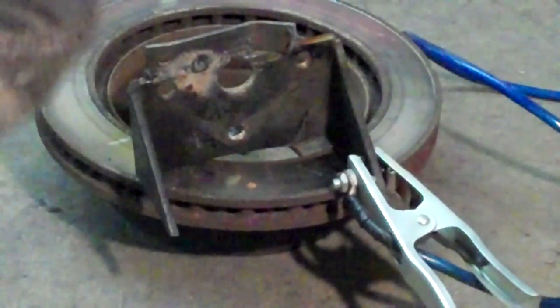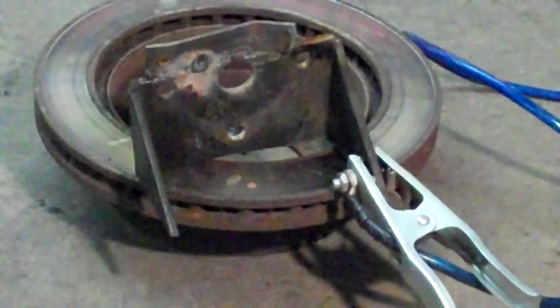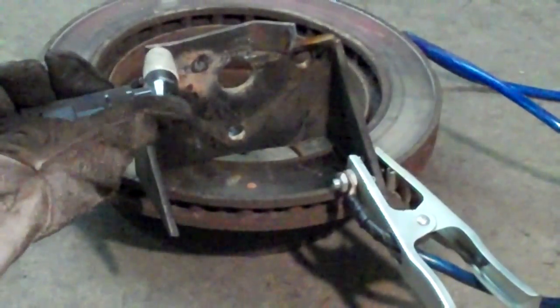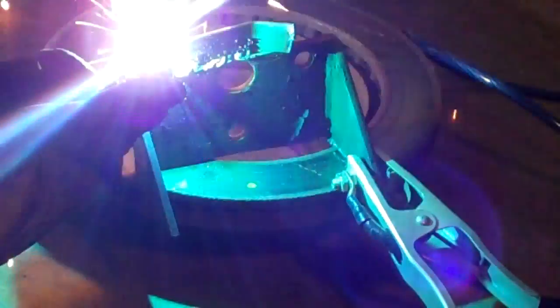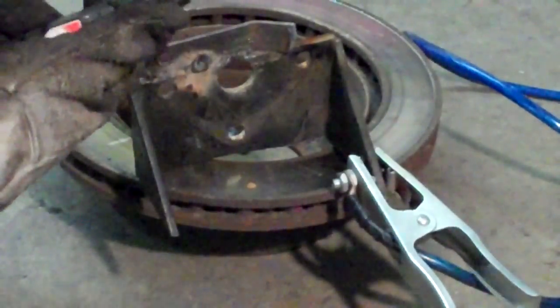You'll know if you got it right or not, or if you're stacked right, if this goes on all the way. It's really tough to keep in frame when zoomed in. So again, I am a millimeter, maybe 2 millimeters from the work, and it's not igniting. So I'll strike it. I've only been cutting for a matter of seconds. I look at the tip and it's actually kind of okay still. It's not horrible, but it is a little bit consumed.